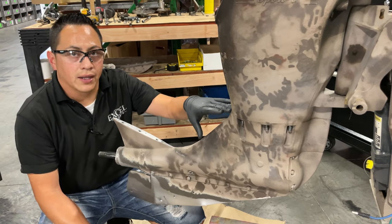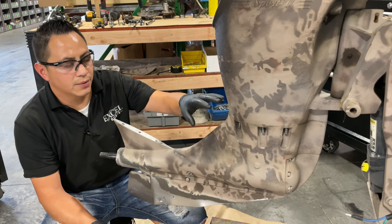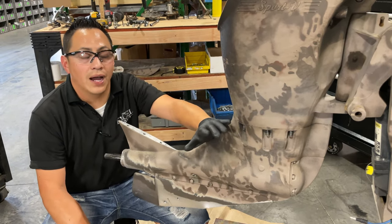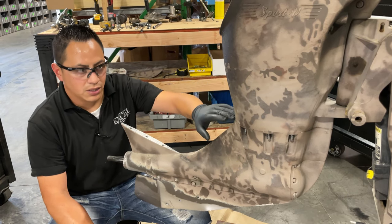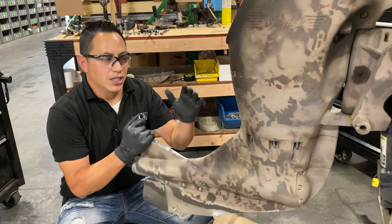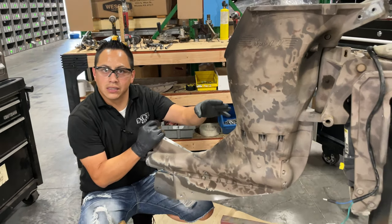When you need to remove it again, it's not going to be sticky — once you break it a little it'll break and fall. I had one occasion where a guy sent it all the way back here because he could not take it apart. Whoever did it used red RTV, and that was a nightmare — he actually had to buy a whole new transmission casting. I grabbed a pneumatic hammer and cut all around the transmission; that was the only way to get it out. So just go to the auto parts store and get some black RTV — I believe it's called Ultra Black from Permatex. It'll be money well spent; very easy to apply and remove.